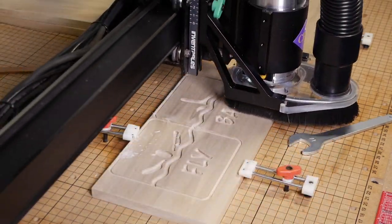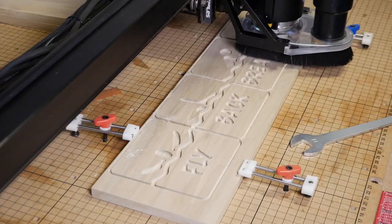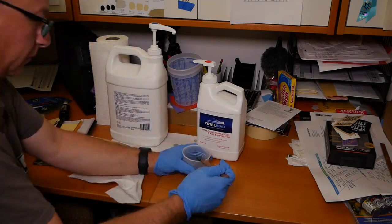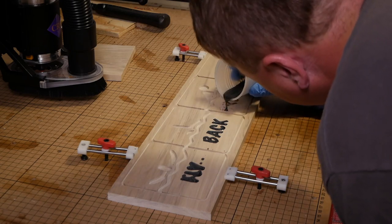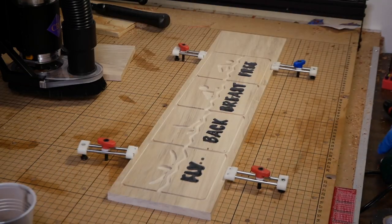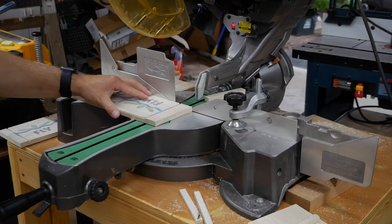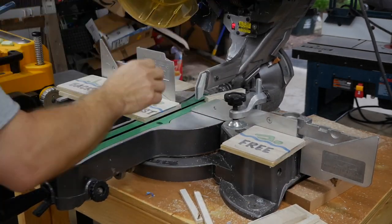It switched here to do an outline, which really helped me line up whenever I took it over to the table saw and miter saw to do the final cutting. Next I'm pouring the resin — I'm using TotalBoat High Performance two-to-one fast hardening resin with a little bit of Black Diamond mica powder, which turned out fantastic. I did three colors total: black, blue down the middle, and green which I did not get on camera.